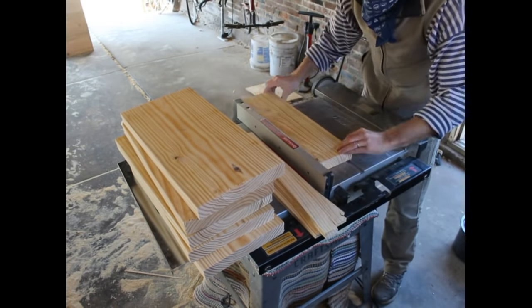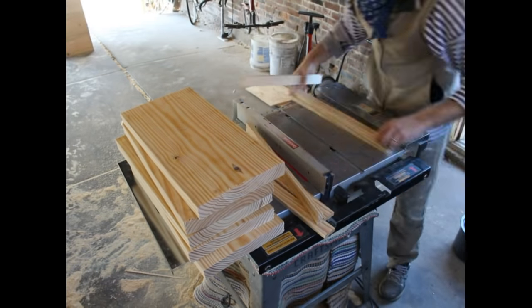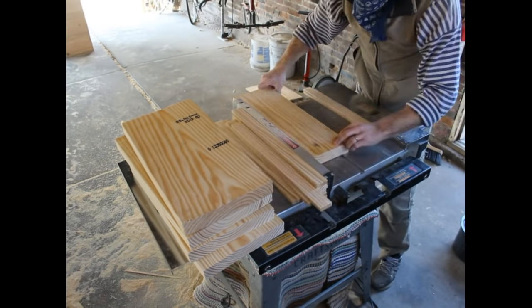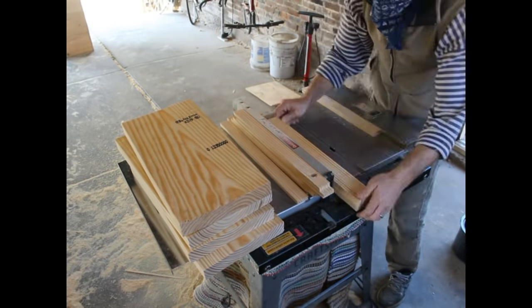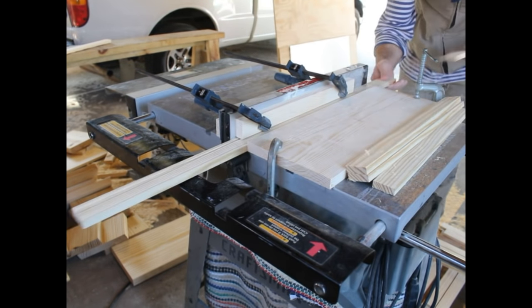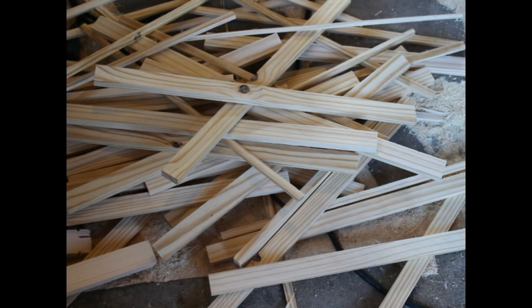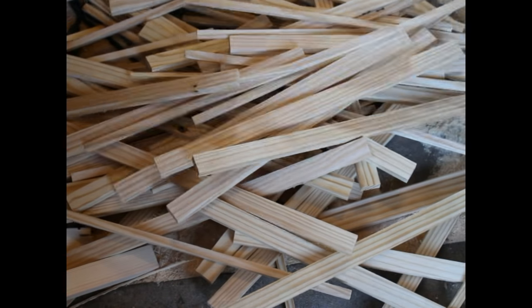Here I am cutting the tops to the proper height. I'm going to run through all of these to make 72 different tops. That's a half inch thick. And then once I get all those through, I have to run them through and trim them up so that they're the right width, which is like an inch and one sixteenth. You can check out the plans at besource.com.